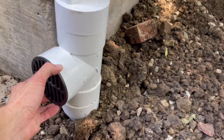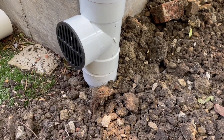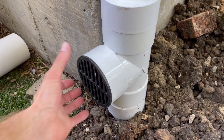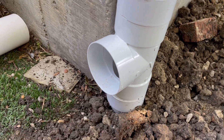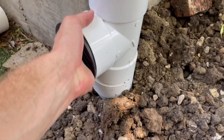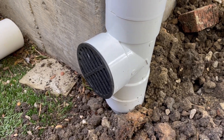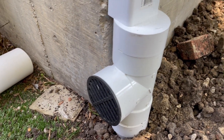What we've got here is a really simple way to do a clean out. This is just a standard T-coupling added between the 90-degree turn into the downspout. You can easily access this by pulling this off and putting your hose or hydrojet machine hose down there. It's offset so it's not going to leak any water, and it just makes for an easy way to clean this system down the line — otherwise it can be really difficult to get into these systems.